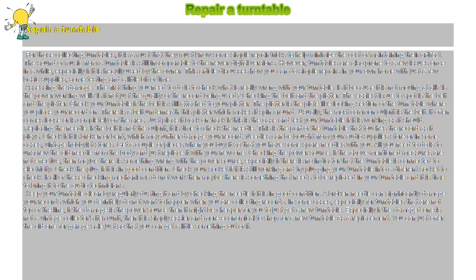Needles can be bought from your audio supplies store or, in some cases, vintage hobbyist stores. Get a couple of pieces when you buy it so that you have some spare needles with you. All you need to do is unscrew the old needle from the body and just replace it with your new one.